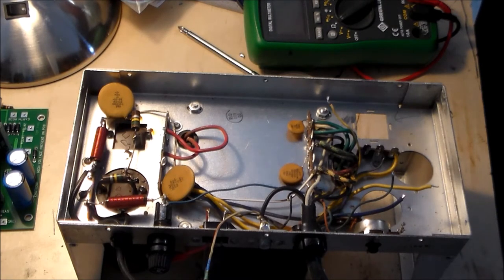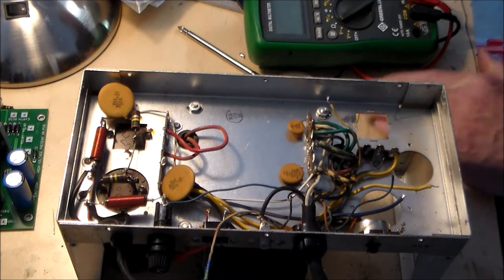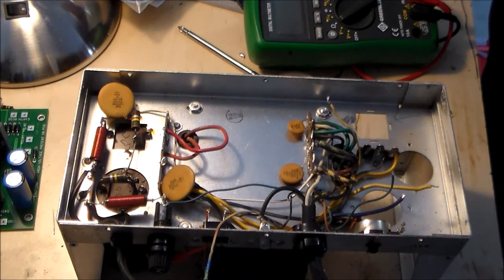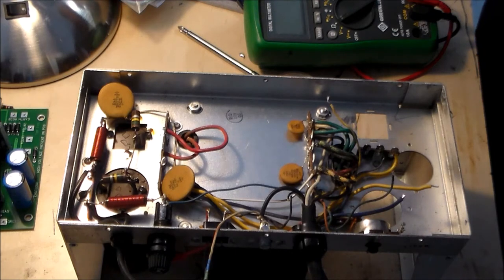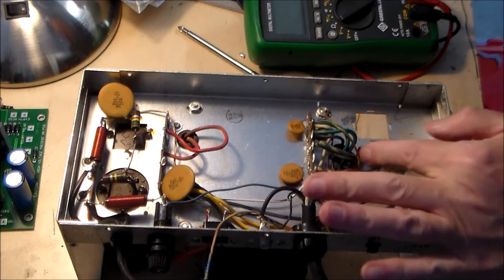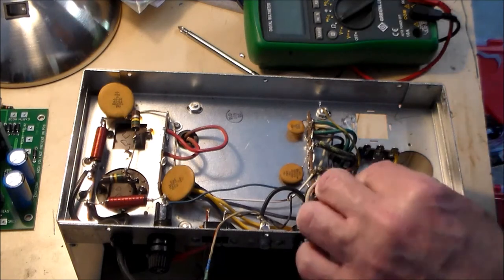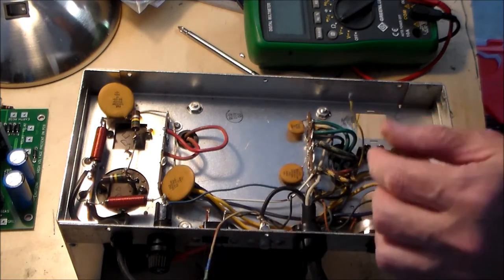After removal of the old caps and diodes and resistors, check your work. You should now have all three bottom capacitors removed. The center terminal strip should have one yellow wire connected. Yes, there's a blue wire there. A small gray wire is also connected to the ground terminal on the strip. There will be one unattached large blue wire, one unattached large yellow wire, and an unattached small green wire. Yes, yes, and yes. Actually, there are two unattached yellow wires.